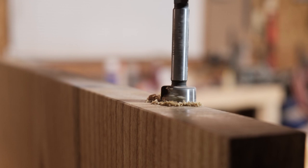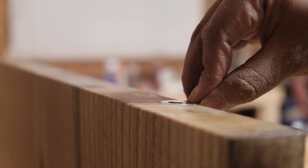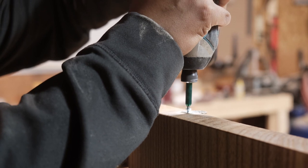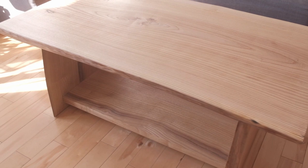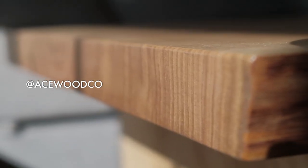To assemble the coffee table top to the legs I ended up using heavy duty figure 8 fasteners with inch and a quarter number 6 screws. This will help with the wood movement of the coffee table top to the slab, and you'll hardly see these fasteners too, which is nice. And there you have it — an ash live edge coffee table. These were two beautiful slabs with beautiful grain and a touch of curls. I'm super happy with how this turned out and it's going to a beautiful cabin. The clients are happy and that's what we always want to strive for. If you like this build please hit that like and subscribe button — thanks for watching and we'll catch you in the next one.